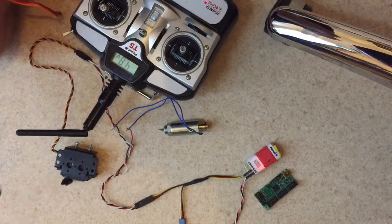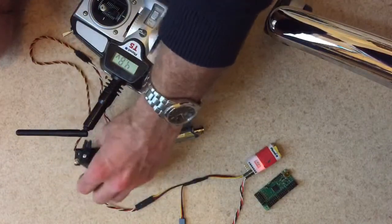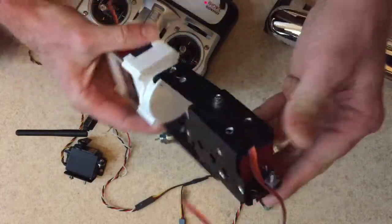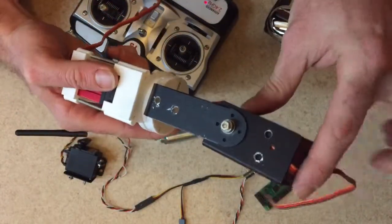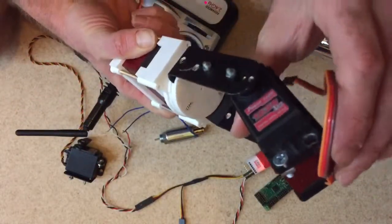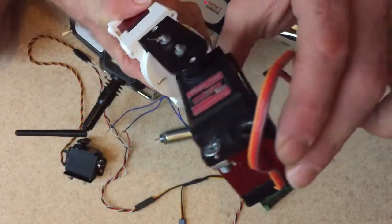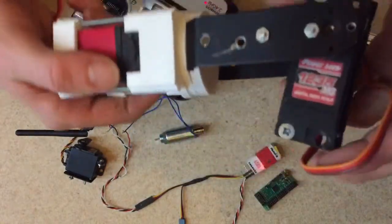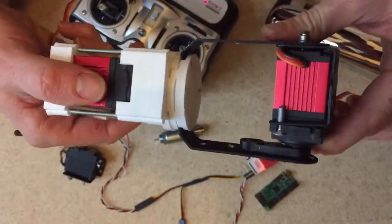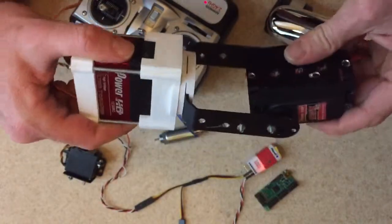Hi, I have a very specific question about solenoid brakes for servo motors and how they relate to robotic arms. As you're probably aware, if a hobby servo motor has a lot of weight on it, as in the case of an arm or a head or a leg, gravity will simply allow it to fall and crash. If that was an arm hanging that way, it would fall down until it faced down towards the center of the earth. To prevent this, we need to install a brake.